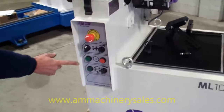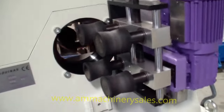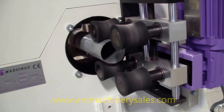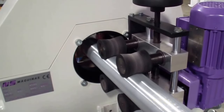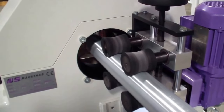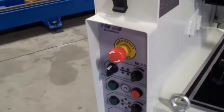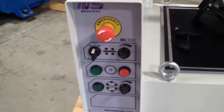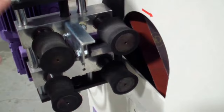Now we're going to show you how to process the material that we just set the machine up for. You're going to start your planetary, then start your abrasive belts and adjust their speed as you see fit. Use the foot pedal to slow down your abrasive belts and allow your tubing to enter the machine. The speed of the abrasive belts you choose is going to be determined by your material — if you need to remove a lot of stock or a weld seam you might need more speed. The speed of your automatic feed relates to that as well: the faster the material moves through the machine, the less material you would theoretically remove. If you need to remove an excessive amount, you would want to slow the automatic feed down.